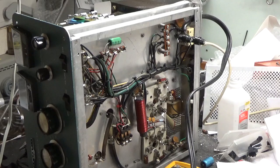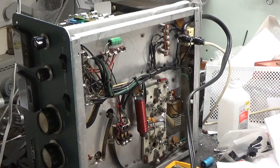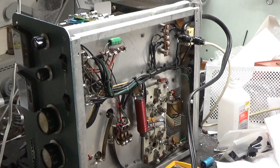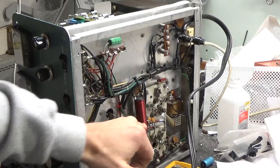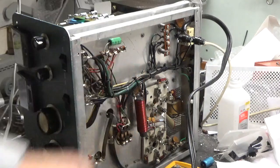So I'm going to go ahead and turn it on. You'll end up seeing AC on my meter, and I will key it manually with the RCA jack touching the chassis, and that'll tell me that the winding is okay on the filament transformer. If I touched it and the relay didn't engage, then next step would be to make sure I'm actually getting voltage at the coil of the relay, because you could have an open relay coil, or I'd actually take the reading at the actual capacitor.